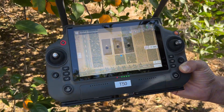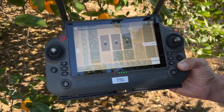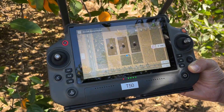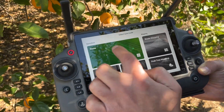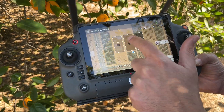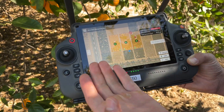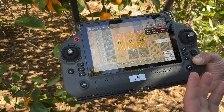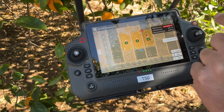We have three fields — each field is about one acre so the total would be three acres. One important thing to mention: multi-task only works in route mode. Now to select the fields, just select the ones you want to merge together. It will show you 3.2 acres as the task area and 8.97 gallons as the estimated spray amount, but we can change that.